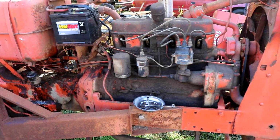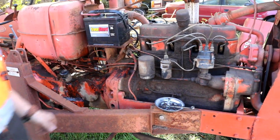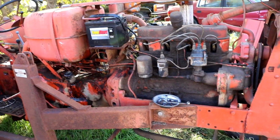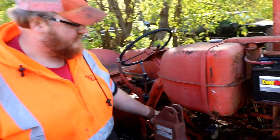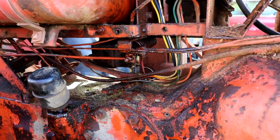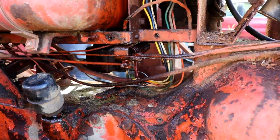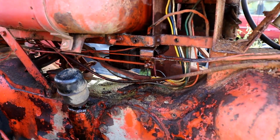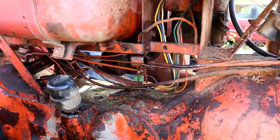And then I got it to crank over, and the throttle was sticking on here, so we had to take the side cover off, if you noticed that was there yesterday. But the linkage down here was fine, but where the battery must have leaked before, it dripped down onto this hinge there. So I had to work that back and forth.